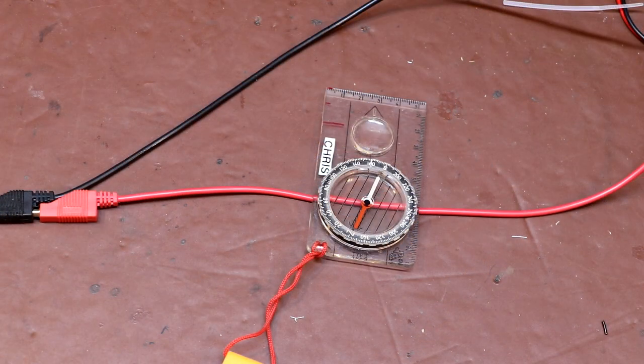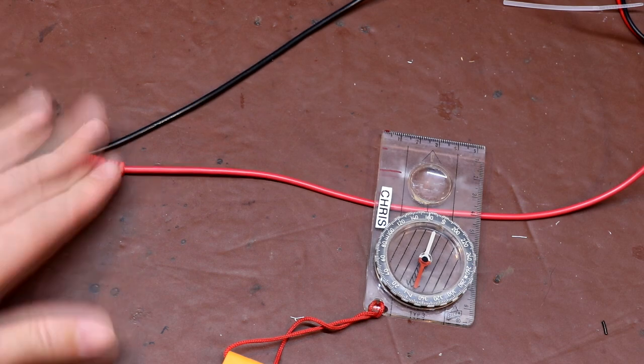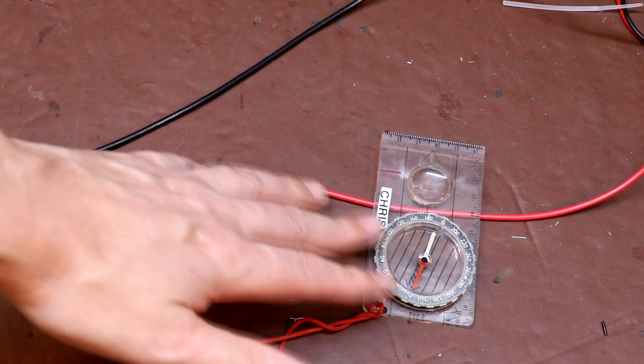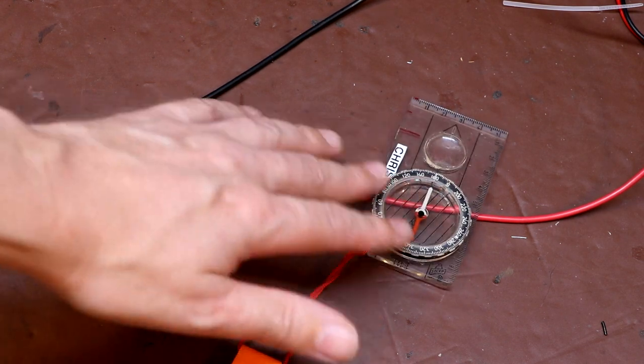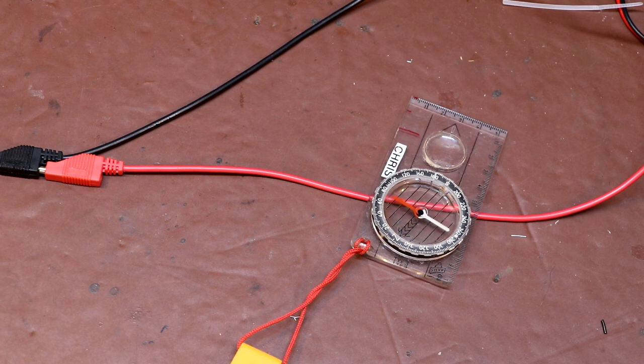But it doesn't have to be a coil of wire to produce a strong electromagnetic field. Actually, any wire that's got current flowing through it will cause that. So you can see I've just got one of my old compasses here. It's lying on a piece of wire, and this piece of wire is just connected to my power supply. So if I just turn the power supply on, we should see this needle twitch. It's going to respond to the magnetic field. So that's a wire. You can see the effect that we get there just by running 1 amp of current